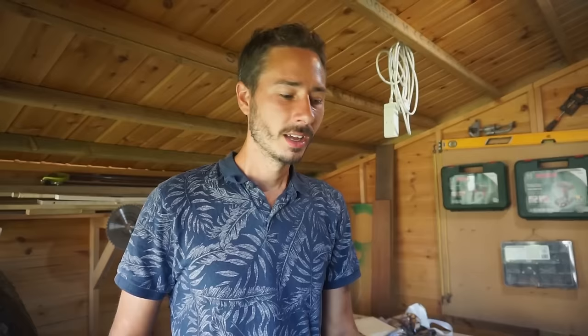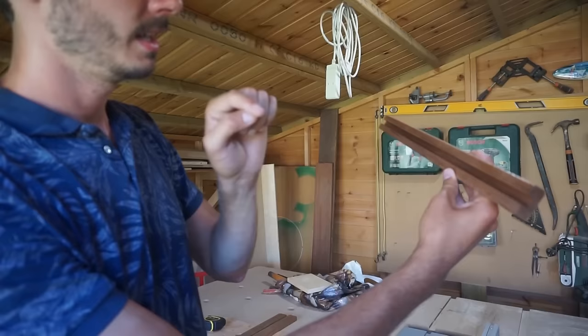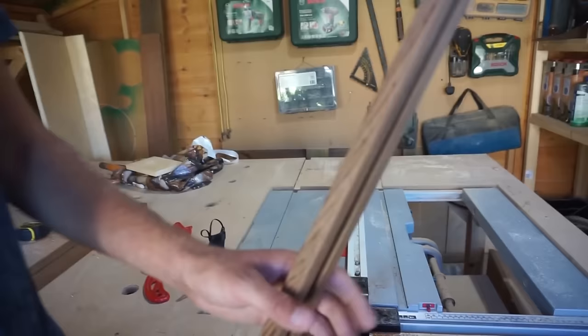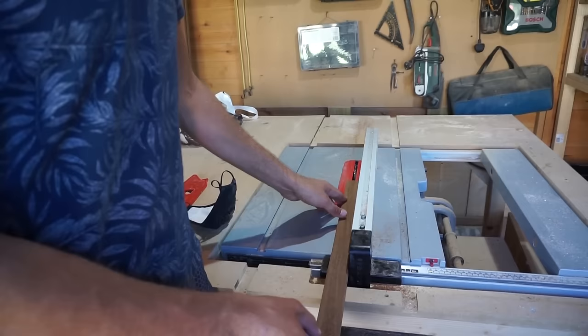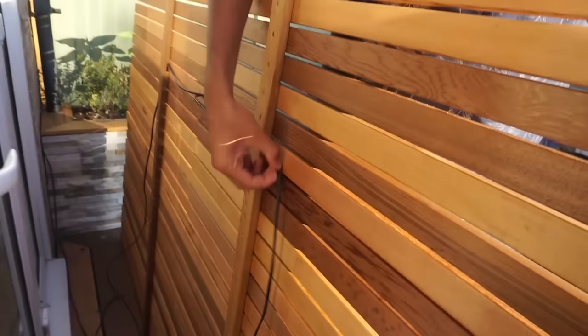On these two screens we're going to have two lights, and the wires coming out the back I want to go into these channels. These pieces of wood will sit on the other side of the screen — the wires go through the screen, down this channel, and then off into the plug. I'm channeling these out by setting my table saw blade to the height of about 5mm, and then making four or five repeated cuts varying the distance away from the blade. The channels are all made that are going to attach to the back of these battens, and I've also routed out two gaps here for the wires to go through.